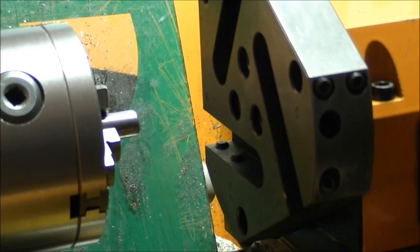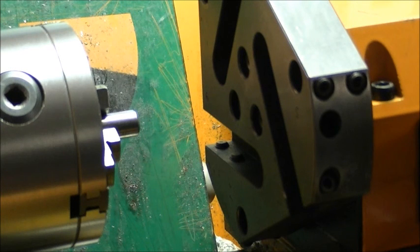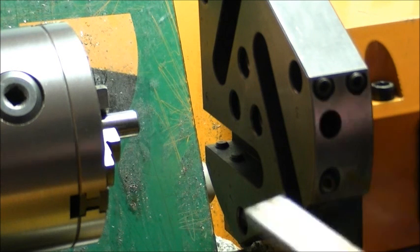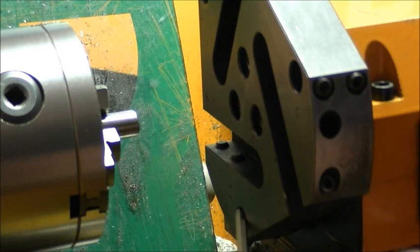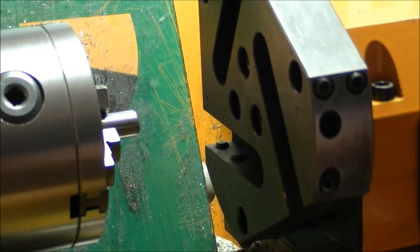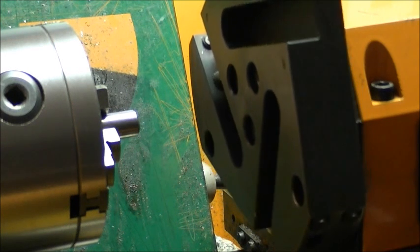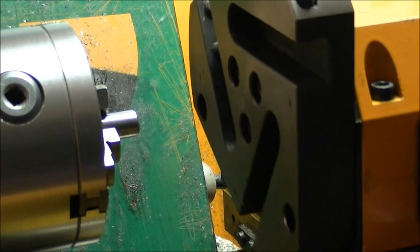So we'll move it. We're set up at the moment on one of the 12 by 12 or half inch square tools or whatever it might be. We'll move it round one position to bring this 10 mil round tool into the working position. So it's press forward and then one and release. It goes past it and then drives back onto it.